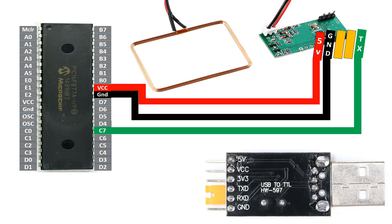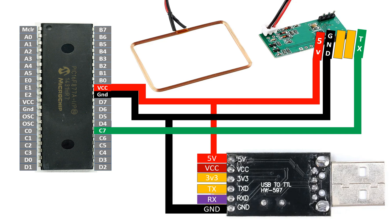The USB2TTL device — it's a CH340; FT232 and CP2102 are also available. No matter which USB2TTL device you use, it always has four pins: TX, RX, ground, and VCC. Connect the five-volt pin to the five-volt of the PIC, ground to ground. The module is sending data to the PIC, and now the PIC will send data to the CH340 device. So TX of the PIC goes to RX of the USB2TTL device. The RX of the PIC receives data from the module, and the TX sends this data to the computer using the USB2TTL device.